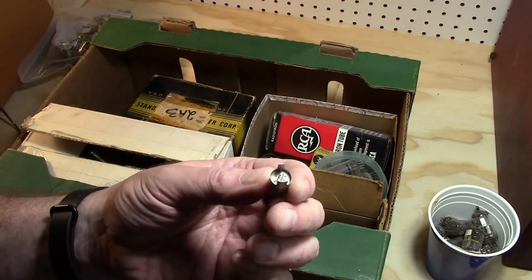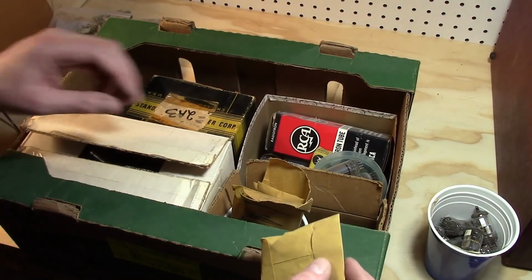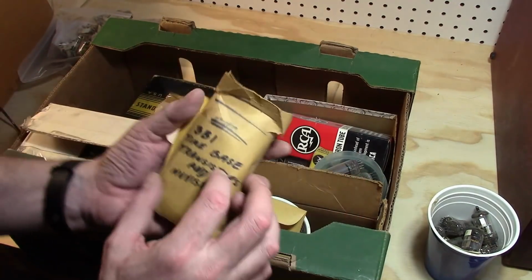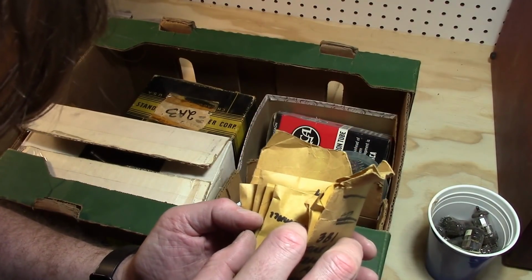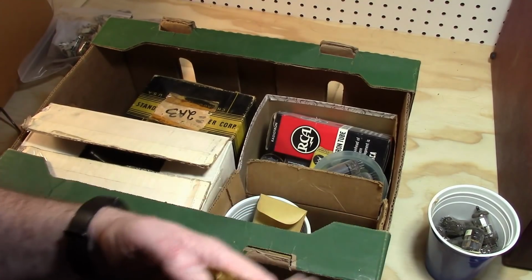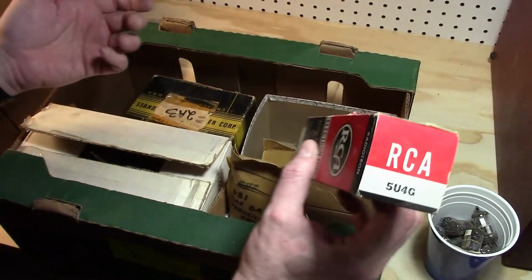These were used in TV tuners primarily, but there were some other devices that used them. I think there might be some type of tape recorder, and some radios used them. And they used them in scopes for the front ends, because they worked at rather high frequencies and rather small. I believe Tektronix would hand select it, go through a whole mess of them, and pick out the best ones. You can imagine they can be a little tricky to replace.